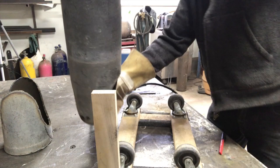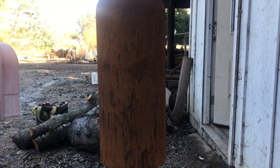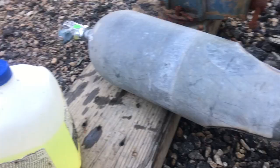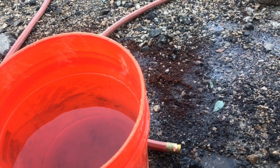I don't know if you can tell, but the tank is galvanized, and I actually want to rust this tank — it's going to be similar to this tank which I've already done. So I want to get that galvanizing off. The best — or easiest — way to do that for me is muriatic acid, and you can get this at any place where they have pool supplies. What we're going to do is — I just filled up a bucket full of water — I'm going to put some of this muriatic acid in here, about two to three to one ratio.